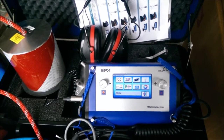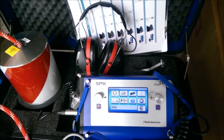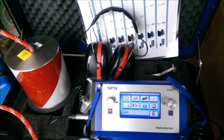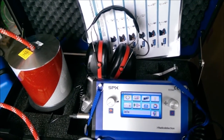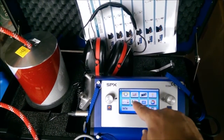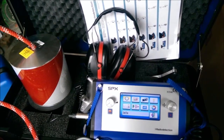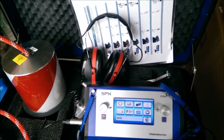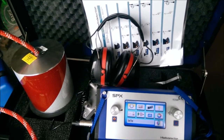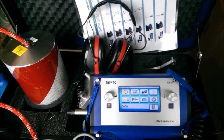Power off time lets you select an automatic power off anywhere between 1 and 60 minutes. There's also a backlight option adjustable from 0 to 100 percent, and a frequency range setting where you can change the high pass or low pass filter by setting the minimum and maximum. Hearing protection is the next option - this unit has an automatic noise level absorber which ensures noise requirements meet VBG 121, and you can adjust the headphone intensity accordingly.